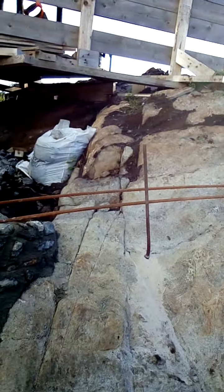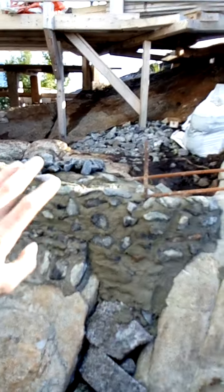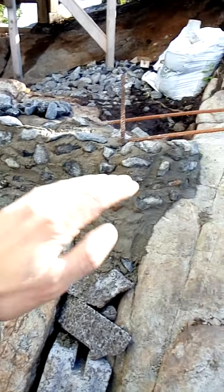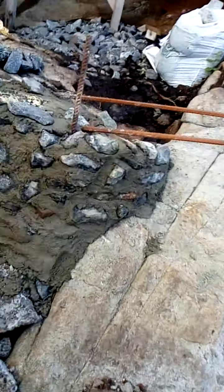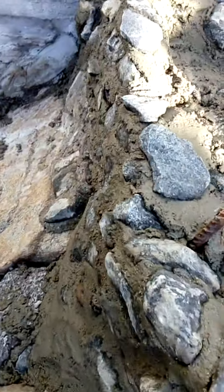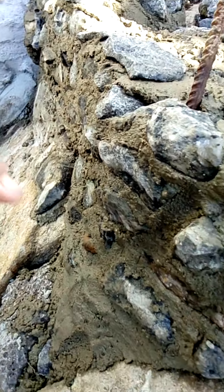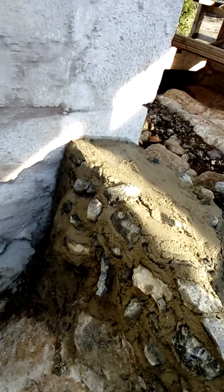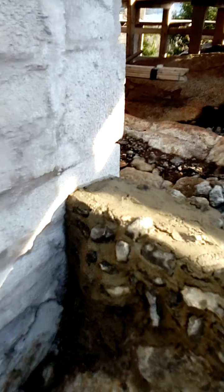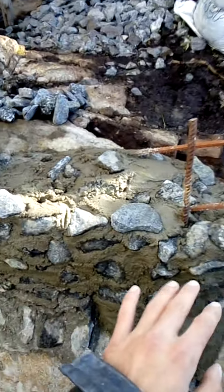The way I go about making this stronger is by taking granite — a very hard rock intended for construction. You should not just use any rock. I stack it purposefully: the flat ones make the edge and can poke out quite a bit. My logic is that if the rocks hold with no mold, it will be very strong once the concrete hardens. My logic may be flawed — if you know anything, feel free to tell me — but you can see there are quite a lot of rocks jammed in.